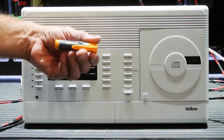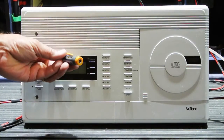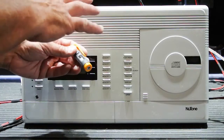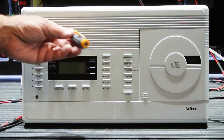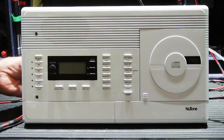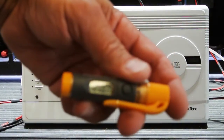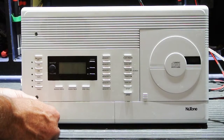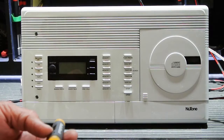What I have here is a little infrared temperature sensing device. I'm going to measure the temperature of the component — the voltage regulator — before we turn the set on. This has been sitting on the bench for about 20 minutes, so it's at ambient or room temperature. It shows about 27 degrees Celsius. And if we measure the outside of the plastic case, that shows 29 degrees — so it's about the same.